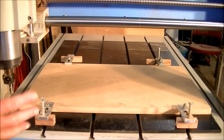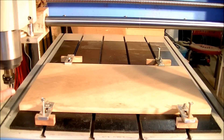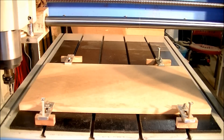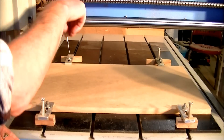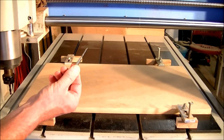I'm going to explain what I sometimes do because this is MDF and it's fairly soft. When I cut a three-dimensional picture in MDF, I normally start off with a 6mm ball mill and make a bit of a trench or a trough, because a lot of people just put the 3mm ball mill in, which is very small, and it ramps in full depth then starts doing a cut and they will snap off fairly easy.